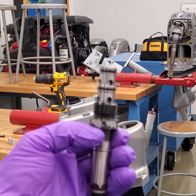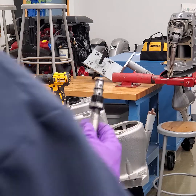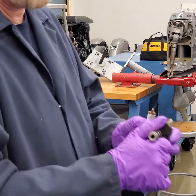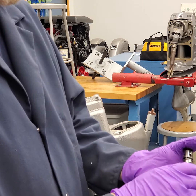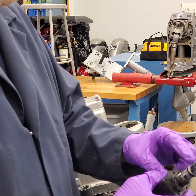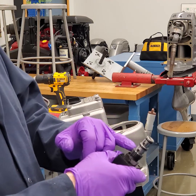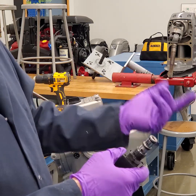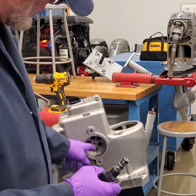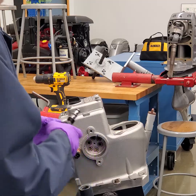Here's one of the valves — it can move in and out. The solenoid itself: when current runs through it, it creates a magnetic field and pulls this piston up into another position. It's strong enough to spring in there and I can't move it by hand. What it does is direct the hydraulic pressure in the right direction. In the neutral position, any oil that comes in will go back out to the sump. When we move this, it will relocate that hydraulic fluid to one of the passageways on the side that goes to the upper clutch pack or to the lower clutch pack.